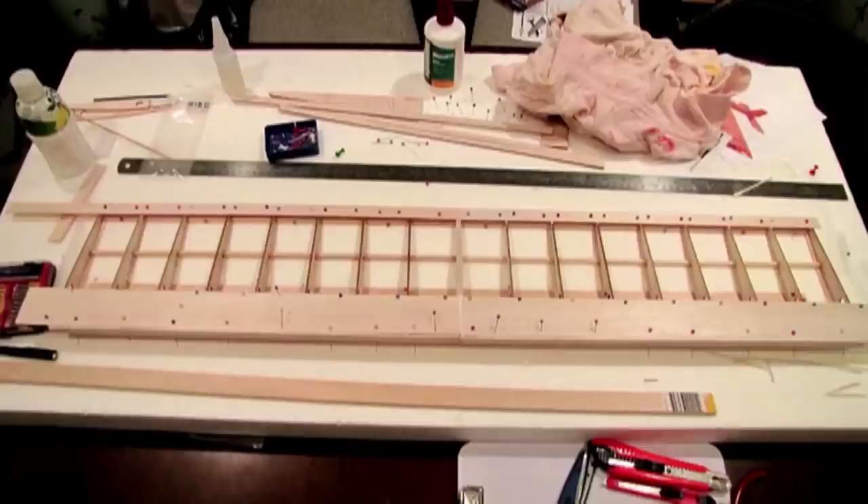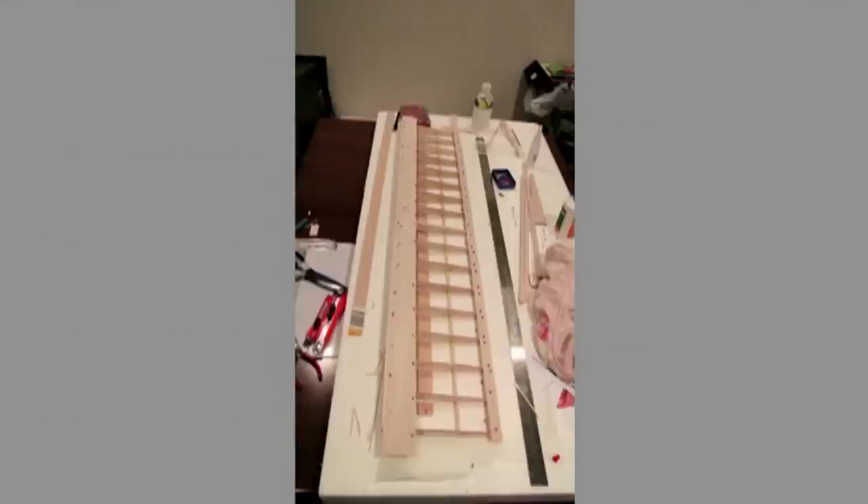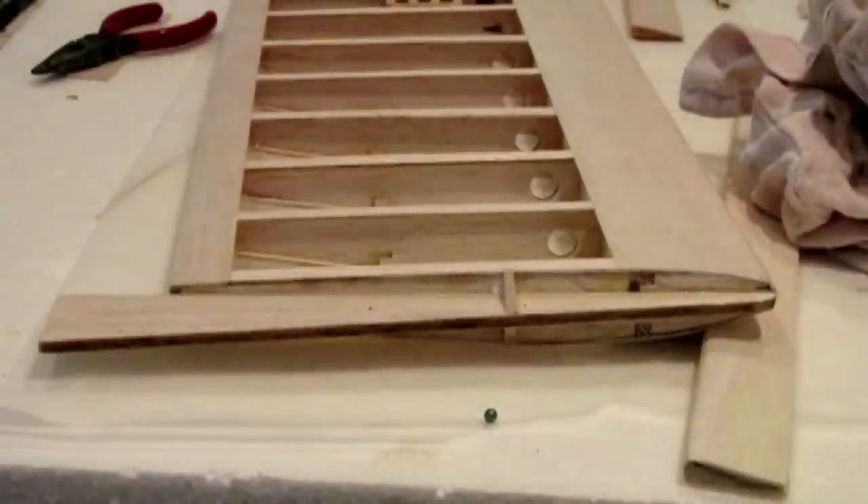You need to make sure the wing is flat and square. Flat and square on the bottom was easy because the bottom of the wing section is flat. On the top it's a bit harder because the top is obviously curved. What I did was anchor the trailing edge hard against the foam and kept it flat along the section before the main spar. A lot of the pins holding the paneling on the leading edge actually go all the way through the wing and into the foam, just to make sure it's all kept flat. On the left you can see the trailing edge stock I bought to use for the ailerons. The wing tips were a bit of an issue — I wanted them running down the middle of the wing rib and also horizontally, but you can't have both, so it was a bit of a compromise. The little gussets you more or less have to cut yourself, but no big deal.